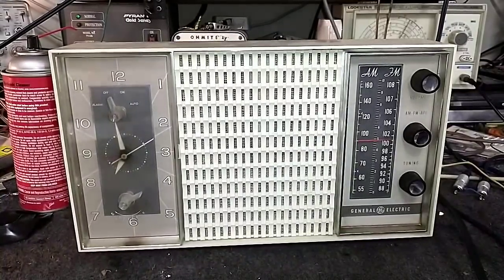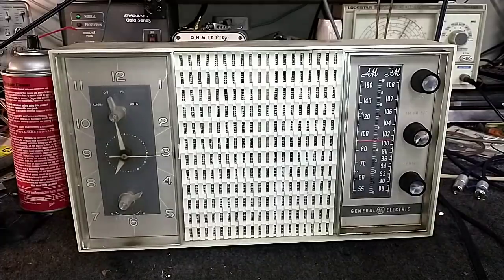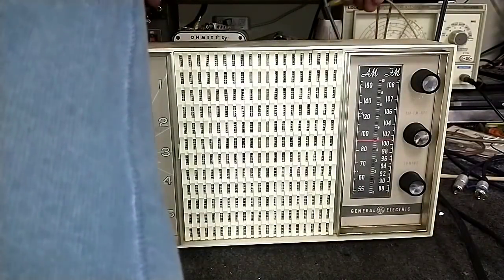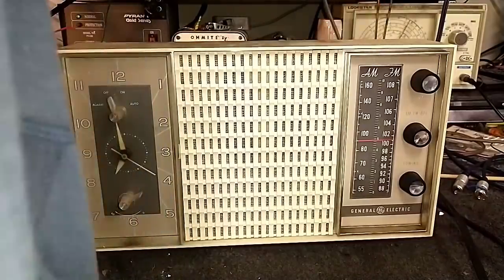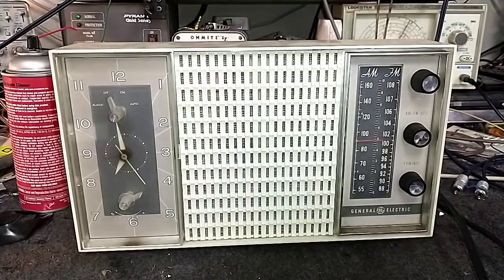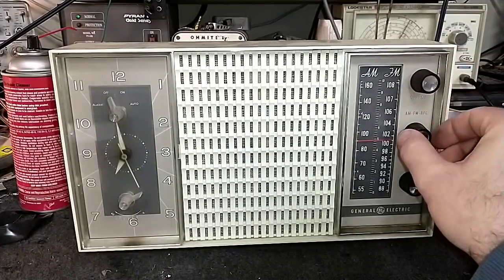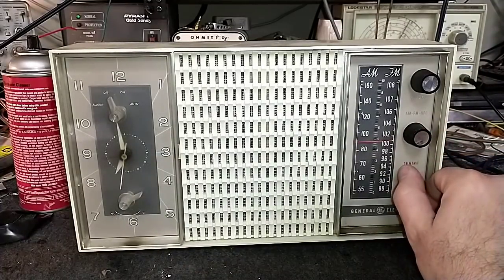And then the third one was the detector tube — he was really sensitive too. So I'm just going to hose that and clean it up. Let's see if that made an improvement on performance at all. Alright, it's warming up — let's see what happens. Oscillator is still way off, but the bleed-through is gone.